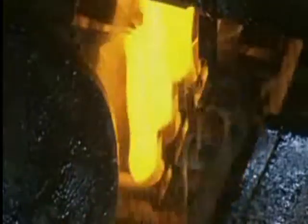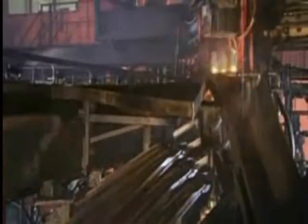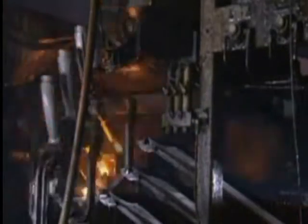After 24 hours at 1500 degrees Celsius, a gooey liquid that's the consistency of honey is produced. The molten glass pours out of the furnace. Shears cut the flow at precise intervals to produce cylindrical globs. Each glob is the exact amount required to make up one bottle or jar.